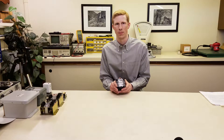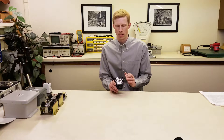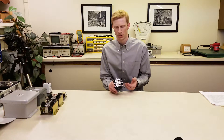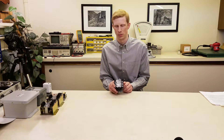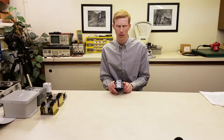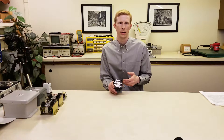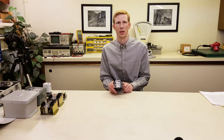There are a couple of main limitations of the 1500 series relay. First of all, they don't perform well with distilled or other very pure water. Also, the probes must be located close to the relay, particularly for the higher voltage versions. Typically, the probes must be within a couple hundred feet of the relay. Another consideration is that the secondary voltage on these relays can be relatively high, which can be a safety consideration in some applications.